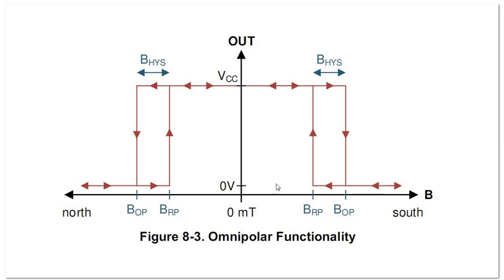Now, this is where it's different from a latch. With a latch, we had to turn the magnet around to the north pole to turn the device off. Now, we turn the device to the north pole and approach the face of the Hall sensor, and the voltage at the quiescent point, or zero milliteslas, drops below half of Vcc. It will reach the B-operating point on the north pole and switch on the corresponding LED. This has two outputs and is a four-pin device, not a three-pin. As you pull the north pole away, the voltage will rise, reach the B-release point, and switch off the corresponding LED.